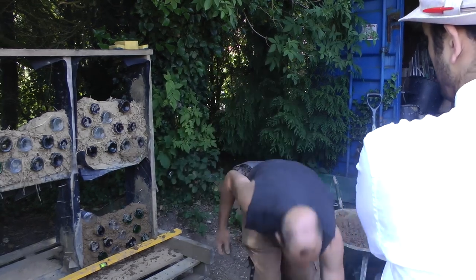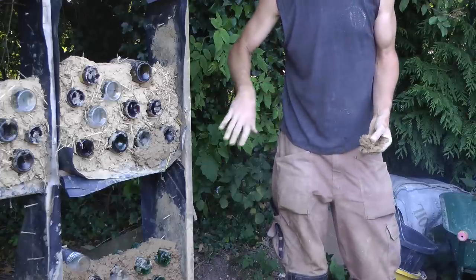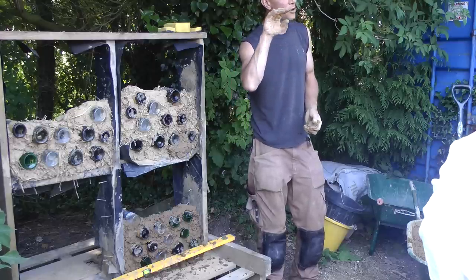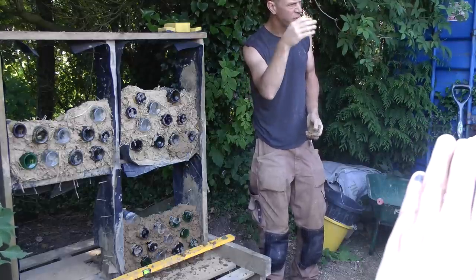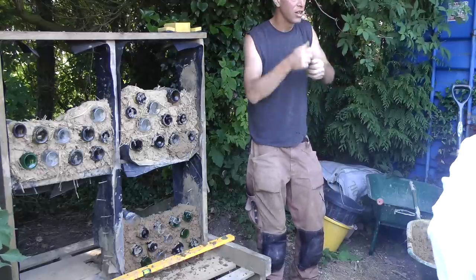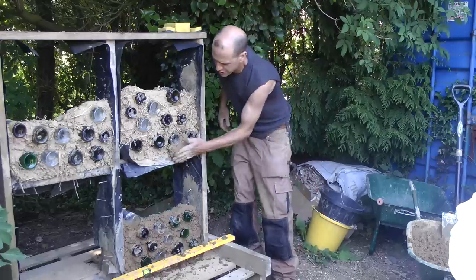This is a form of rendering. Rendering is done on a flat wall with no bricks — you smear a whole layer across the wall. The difference between rendering and pointing is that pointing fills the gaps between materials. You often see builders needed to repoint brickwork where the mortar has worn away from weather. A builder will grind or chisel back about 10 to 15 millimeters from the front, then trowel in a new mix so the mortar is flush with the brick face — it's a repair job to extend the life of your brick wall.